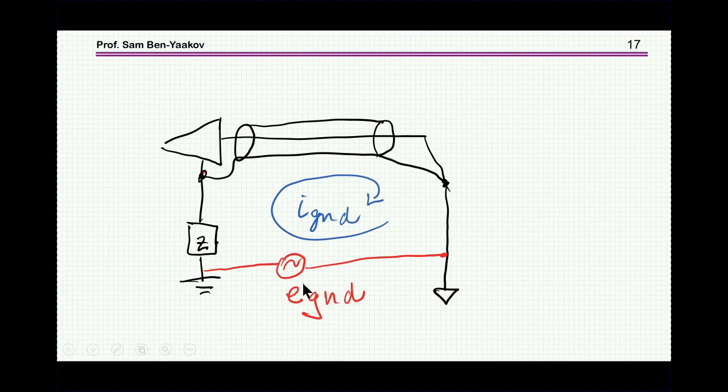And what happens is that I've actually put a wire across this voltage source, and there's going to be current through this ground part, through the sheet. The magnitude of it could be fairly high, by the way. And since this is a low impedance voltage, that is, the source is coming out of a low impedance equivalent source, and it is low impedance because it is generated by the voltage drop on a ground line, and ground lines have very, very low impedances. So the end result is that this source has a very low internal resistance, you might say, and therefore putting here another line, another cable will not short it. Current will pass, but still the difference will be maintained.